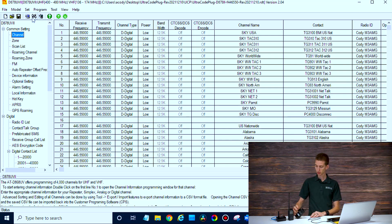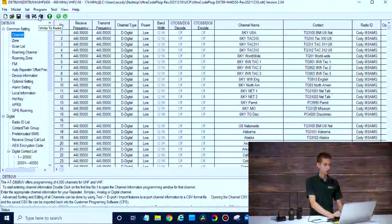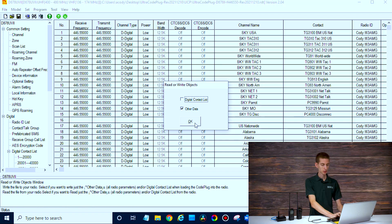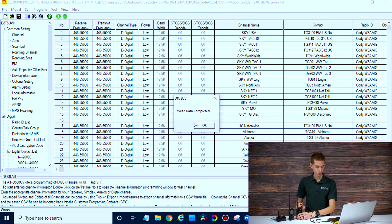There we go — just wait for this to boot back up. Now just click write to radio, and the other data. At this point we could import the digital contact list onto the radio. If you're doing this, you probably want to do that — it's going to allow you to actually see everyone's call sign when you're talking to them. So if I make a contact, it's going to show up on the screen who I'm talking to, and that's really neat. For today we're going to skip over that, leave it unchecked and click OK. It's writing to the radio and here in a second we should be ready to rock and roll.